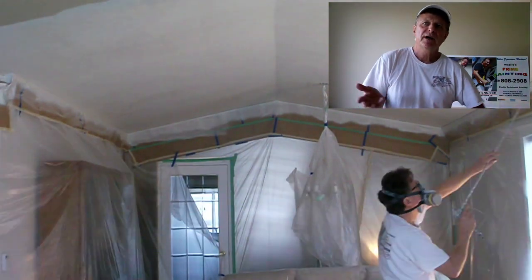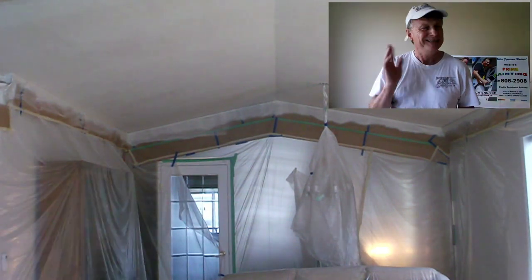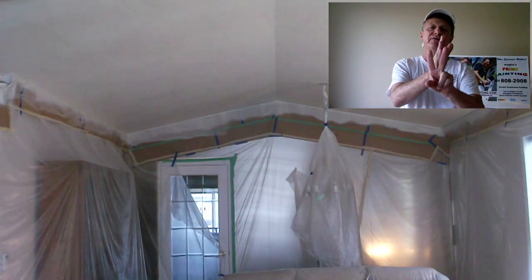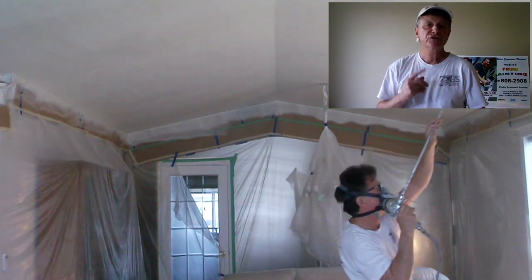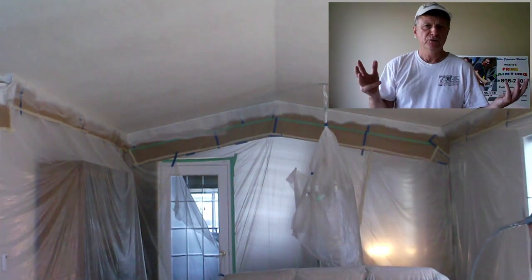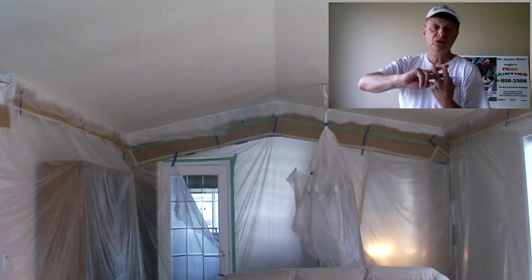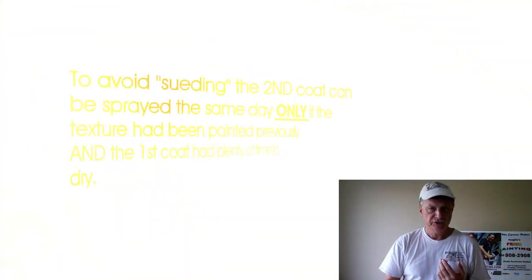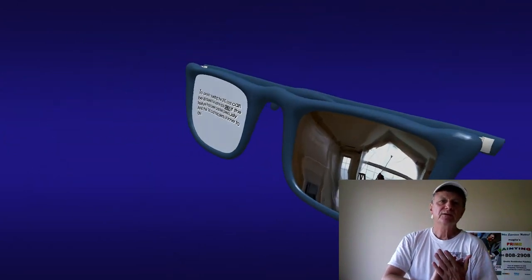You can see what's happening here — I'm doing my opposing-the-light coat. It's really important that when you do two coats, you don't travel in the same direction, at least wherever possible. If you travel in the same direction, your spray patterns will overlap each other and you still get heavy edges, or you might get a rooster tail if you turn the gun the wrong way, or if your pressure isn't set right. I always do my first coat opposing the light. My second coat I'll do with the light, following the natural light from the big windows. That crosshatch pattern guarantees you're going to get a solid finish. Seal whenever it's not sealed. First coat: oppose the light. Second coat: spray with the light.